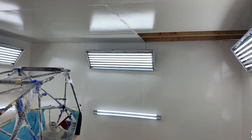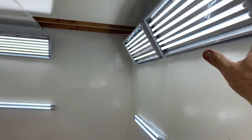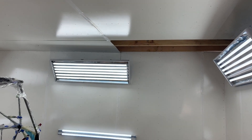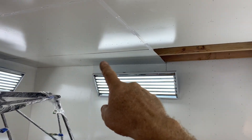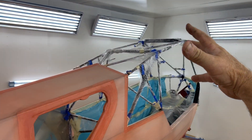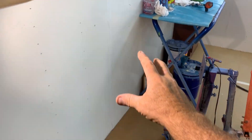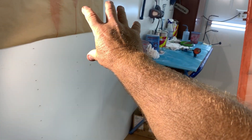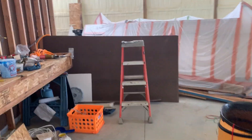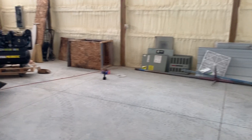When we finish the system, I'm using an actual regular furnace and blower — a large unit out in the hangar — that's going to heat and cool the hangar. We'll branch off with one duct that comes over with two intake ducts high on the ceiling. It'll come across and exit low on the wall over here and out of the hangar. The unit is actually going to sit on the outside wall of the hangar.